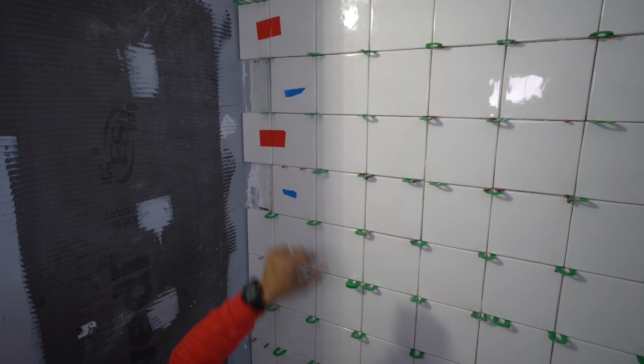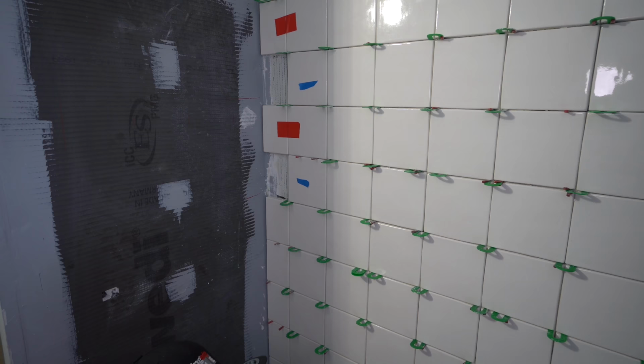And I'm gonna go ahead and finish cutting in those tiles up to the ceiling. Cutting them in really nice and tight. What we do here in this situation is every two rows I go ahead and level off and get this all nice and tight. And that's going to be it. I got two corner shelves going over here. The blue tile represents the tiles that I have to take out. I actually set those so that I can continue all the way up. And the next wall is going to be the shower wall with all the cuts in it. And I'm going to go have fun with that.